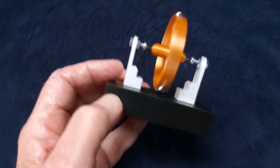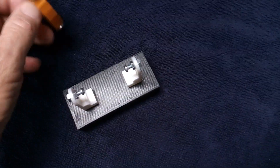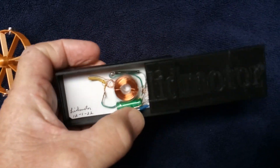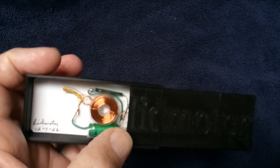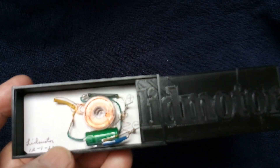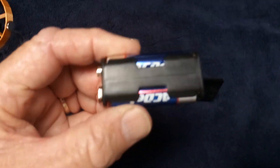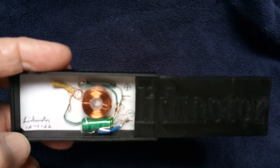Like I said, I made this so it was like the puzzle motor where you could try different things and figure out what you liked best. I finally came to the conclusion that a reed switch driver was the best thing here. Inside there's a slide lid, and there's the little driver - that's all there is to it. It's a coil, a reed switch, and a 2.7 volt small supercapacitor. You just fill it up from a battery to charge it up, close it back up, and it runs for about five or ten minutes.